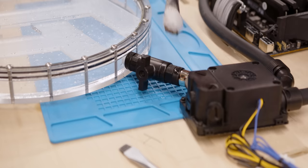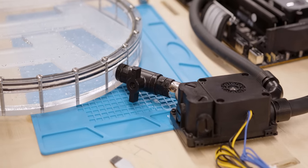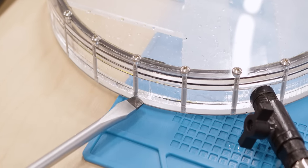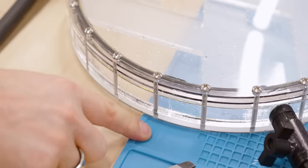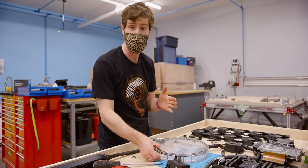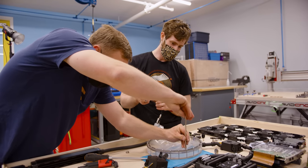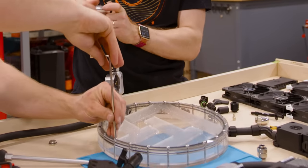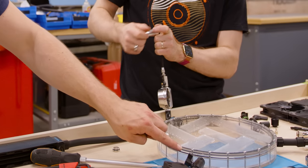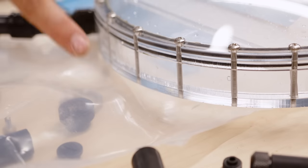I hear one - it's leaking again. A really good way to check where a leak is coming from is to use some soapy water - you'll start to see bubbles where the air is escaping the system. There's not enough o-ring crushing going on right here. See how you can see the o-ring being crushed here and over here, but not right there - that would explain the little spill. The bad news is that will significantly delay our test of the whole loop. The good news is that should be a relatively simple fix with a thicker o-ring. I haven't tightened these since I originally put it together like a week ago and it's been holding water. One thing to note: the acrylic I used is cast, so it's not very level - there's a 0.8mm difference in thickness across the entire thing, so you're taking these unflat things and trying to smush them together.